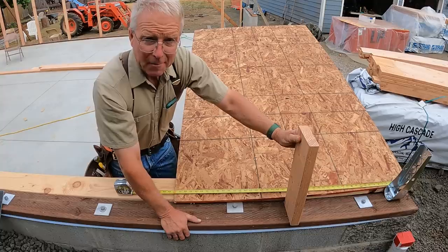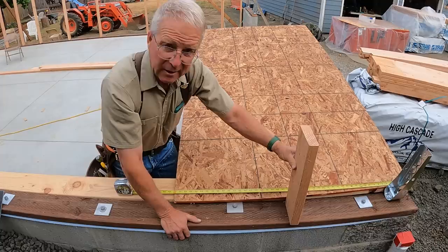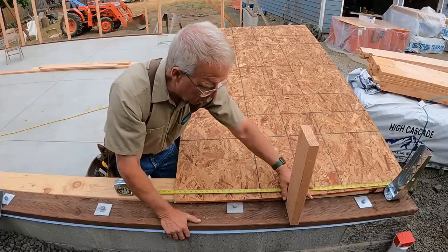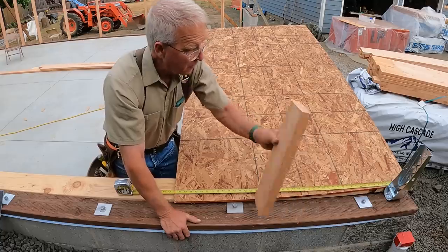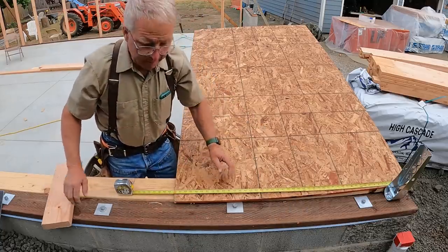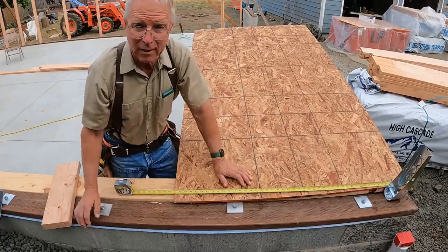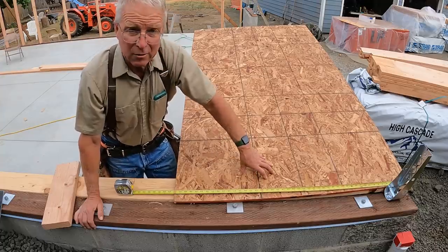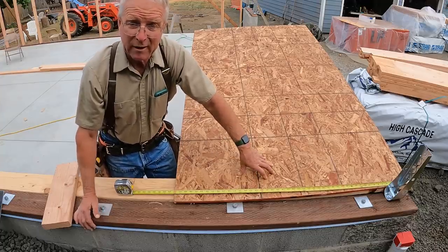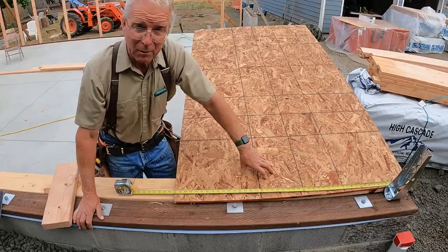I mean, that's wood framing 101, right? But if that's where you're at, sometimes it's a question mark about 16-inch on center. Do I put the edge of the stud at the 16-inch? Do I put the far edge? Where do I put the stud? So the thing that controls that is the width of the material. And on the west coast of the United States, and the United States generally, and maybe in other places, most sheet goods are 48 inches wide, 96 inches long. That's a multiple of 16 inches in an imperial world.